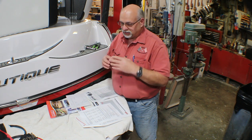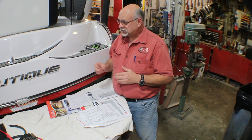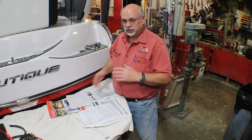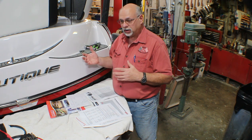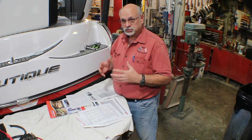So the 95 amp alternator that's gone bad on this one — you may think it's adequate — but this guy is already on another set of batteries. Why do they eat batteries? Why are new boat companies looking at installing high-powered alternators on their newest models? Because the 95 amp alternator just isn't enough to keep a dual bank battery system charged under typical operations.